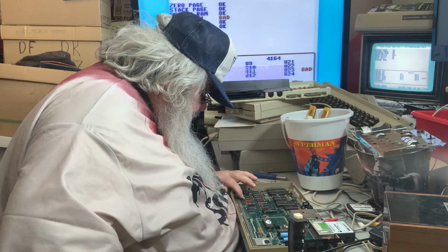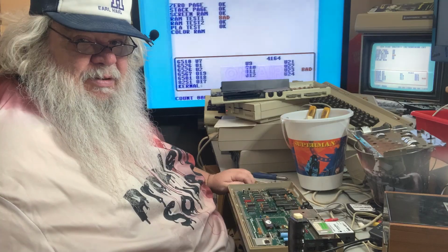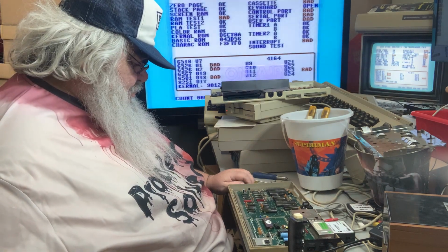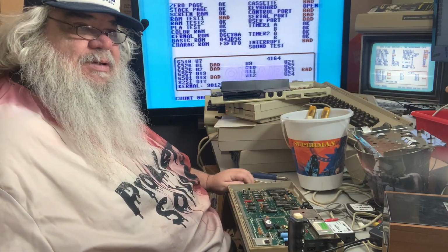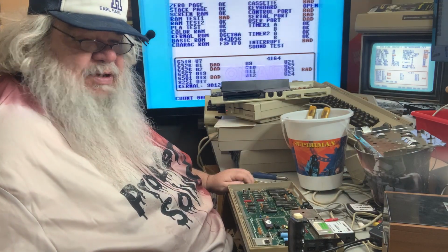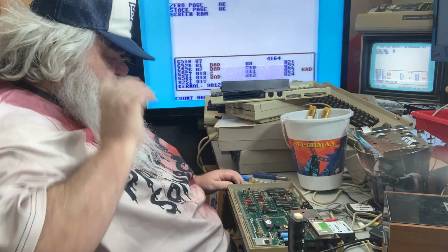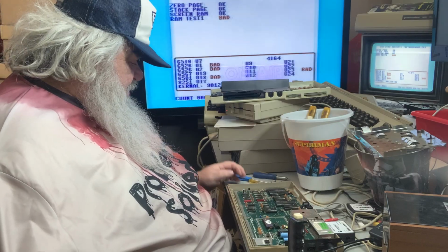Almost get myself in the eye with that. Yeah, and you know what? Not surprising. That chip in here, U-23, is marked with like a white thing. Like liquid paper, if you remember what that is. If you took typing, or you typed, you would find, if you made a mistake, there was occasion that you would take out the stuff called liquid paper. Little bottle, little smear. So U-23 bad, and it's marked.